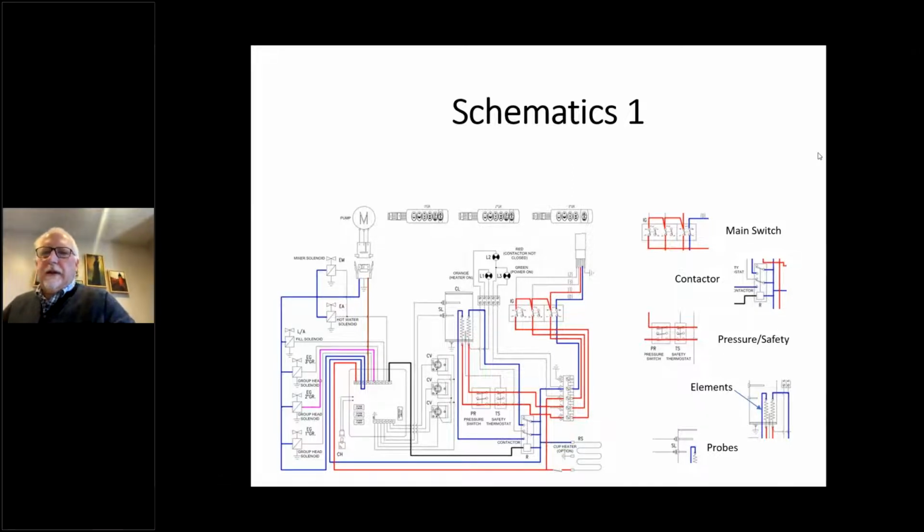Before you actually apply power to the heating elements, make sure the boiler's full, all those kinds of things. And then that second switch, the number 2 position on the switch, is what actually engages the heating elements. That's why the machine's separated out that way. So if you have an issue with a heating element not getting hot, it's probably nothing to do with the main board. It's got something to do with that main current that's coming from the switch to the element, or the element itself.